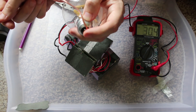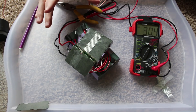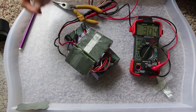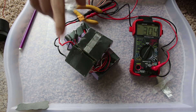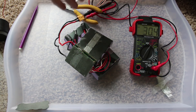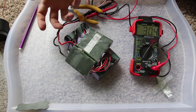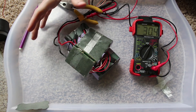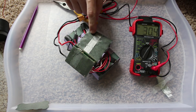What I'm going to do is hook up this resistive load. That's exactly what is happening here. The voltage of this pack is down at the bottom threshold for the BMS. As soon as I put a load on it, the voltage droops, and that drooping is what's causing the BMS to kick in and protect the cells from low voltage conditions. I actually consider this a good sign for this pack. If the pack was discharging itself due to a faulty cell or some faulty condition, then it would actually droop below the cutoff voltage. This pack has been connected — perhaps for a test or some other situation — and the voltage has actually been run all the way down to its cutoff voltage.